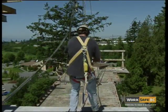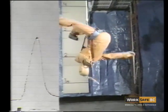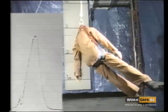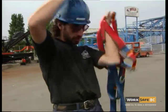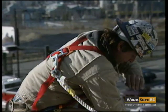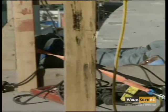Falling into a safety belt could cause serious internal injuries, and harnesses are the preferred choice — but not all body harnesses are equally effective. This test film shows how different harnesses react to the same weight and fall distance forces. It's important to wear the right harness, properly fitted. The lanyard should be connected in line with the spine, where the shock of the fall can be distributed between the shoulders and the hips.